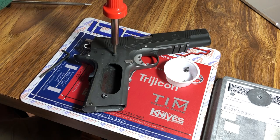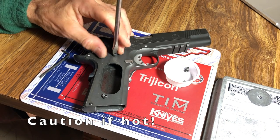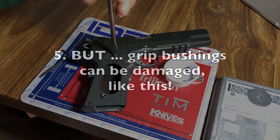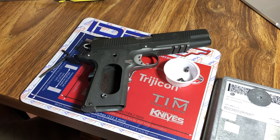Remove the screws, then to soften the Loctite, heat the bushing with a soldering iron for about five minutes to get the temperature above 500 degrees, which is required to soften the Loctite. Then using a screwdriver, fit it into the screw slot in the bushing and unscrew it — it can be very difficult. The first three bushings apparently didn't have much Loctite, so I managed to unscrew them intact.